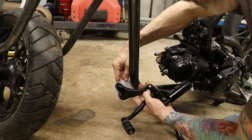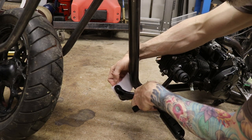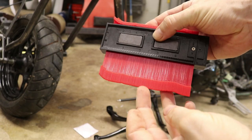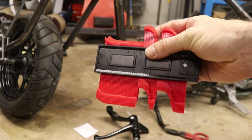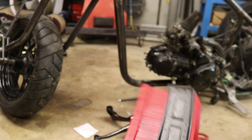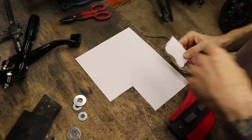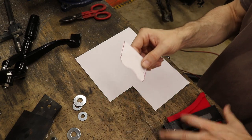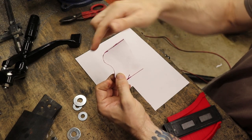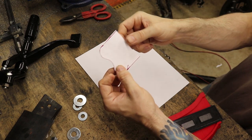I'm definitely not having it out that far — I kind of want them in there, up higher so they don't scrape the ground. I've got this profile gauge tool, which is very cool. With this I can sort of trace the shape of my curve without too much problem. So now I've got this template, and I don't want it to just come straight off the frame — I want it to sort of blend in, with a little curvature on either side.